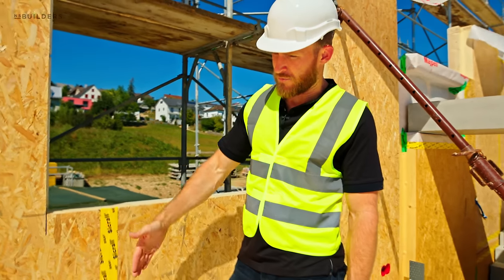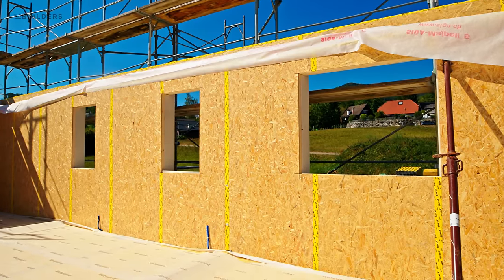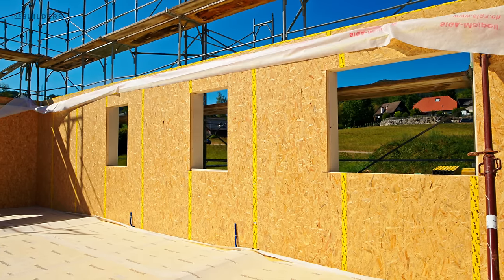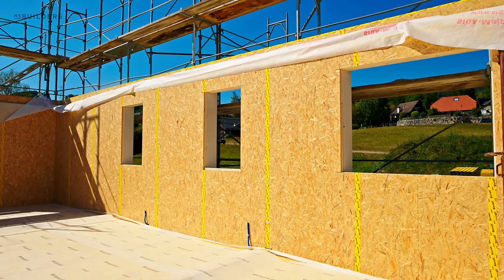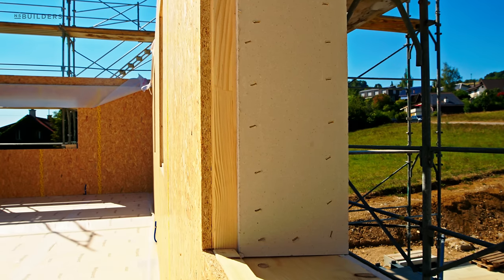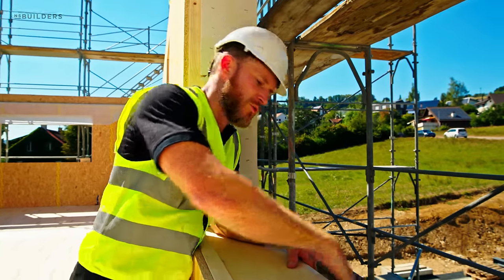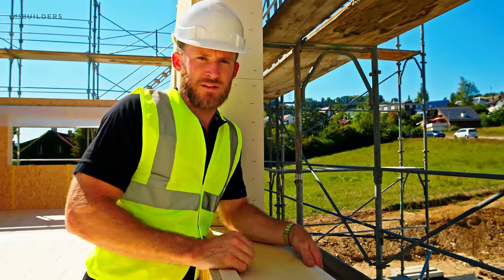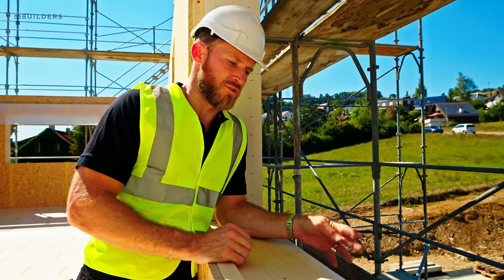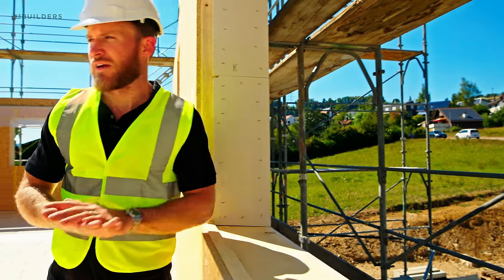Now, you're gonna have your finished material. You see a lot of it's already been prepped for electrical. So there's probably electrical that runs floor to floor and then comes out and they're stapling it there so they can make the connections. But all of these panels that you see are how they came from the factory. On the outside, you actually have this cement-based gyp board, as well as on the outside here. I'm not sure what the cladding material is, but probably something that gets adhered to this surface, whether or not it's the final condition. I would think, based on everything else I've seen here in Switzerland, that they're gonna have some sort of rain screen detail and maybe a panel with a pretty substantial air gap behind it.